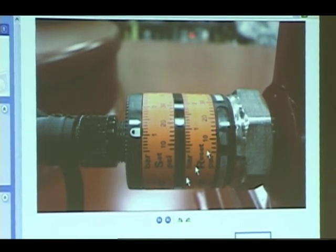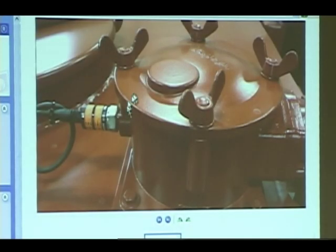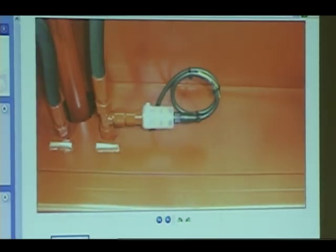This one here is the filter, the dirty oil filter pressure sensor. It's only 20 psi. And that, of course, sits right up there on your canister filter. This is the high oil pressure, and this one's located down. If you stood in front of your power pack and looked at where the hoses are, just to the right of the hoses is your gauge stack. Right behind the pump gauges where the pressure gauge is located.